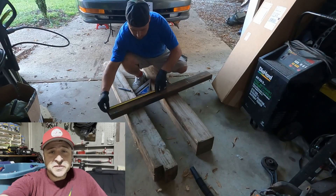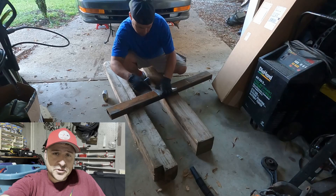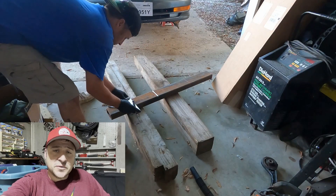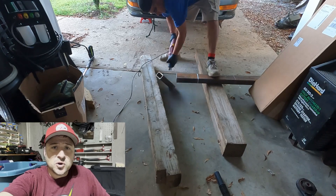Keeping with the tradition of Gas Diesel Garage, I am using some scrap steel. I had some two-by-four steel laying in the garage and I'm going to cut these things — two of them, six inches apiece — and I'm going to put those on as the base plate for the crane and weld those up.